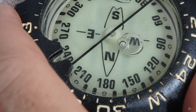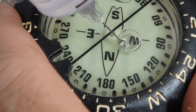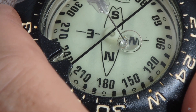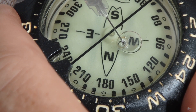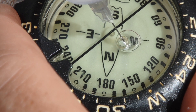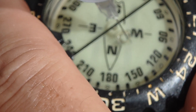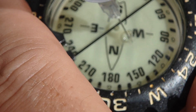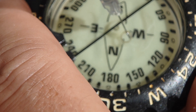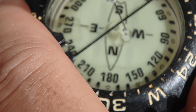The next step is like one of those games you go to at birthday parties when you're 6 years old, where you have to get the little ball bearing into a tiny spot. You insert your needle into the hole where the grub screw was and fill it. You can see gas escaping. Keep filling it. That's all of the gas pushed out, displaced by the mineral oil.